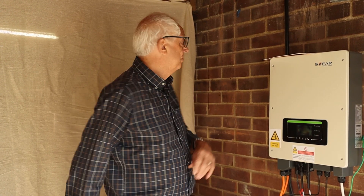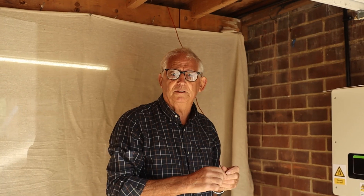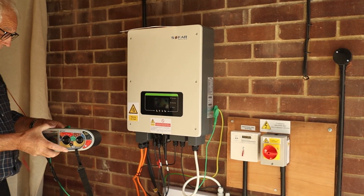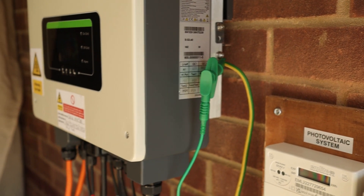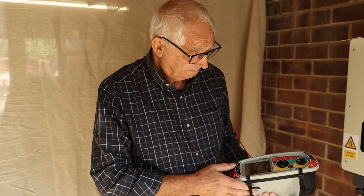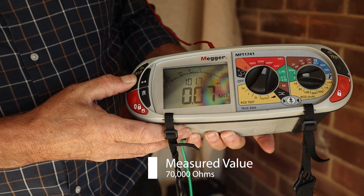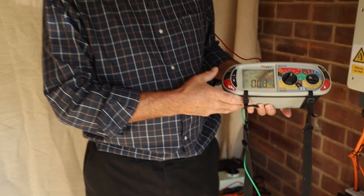I've prepared earlier — I've connected a cable to the array, on one of the rails, and you can see I've got my other cable connected to a known earth. I set my insulation resistance tester to 500 volts. I'll now give it a test — push the button and we've got a resistance of 0.07. So 0.07 is 70,000 ohms. That's way above 22,000 ohms, so that's telling me that this system does not need bonding.